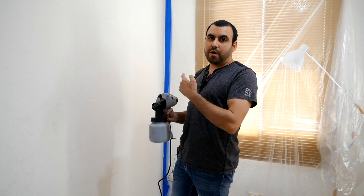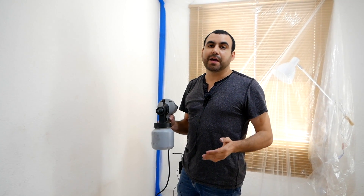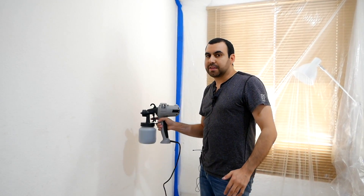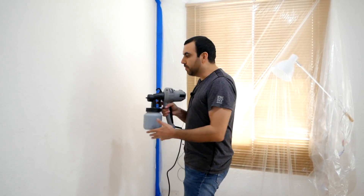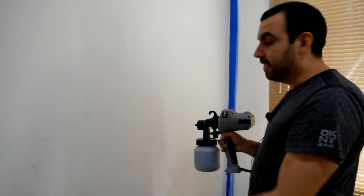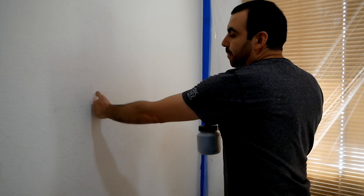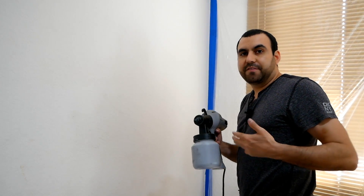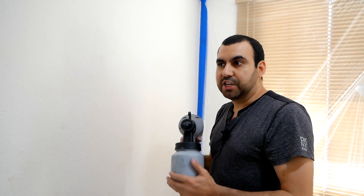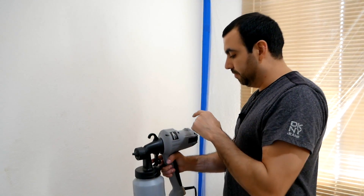Alright guys, I've got my wall prepared and I'm ready to use my Biff Real spray painter. One key thing to using a spray painter is that you don't spray in a circular motion — you do it in a straight motion. If I'm facing the wall, I'm not going to do a circular motion because I'm going to get more paint in the center and less in the other areas. You've got to go straight and try to keep the same distance from the wall, which will vary depending on the thickness of the paint. I already used the viscosity checker and I'm good to go, so let's get testing.